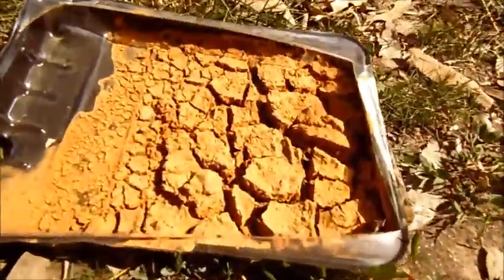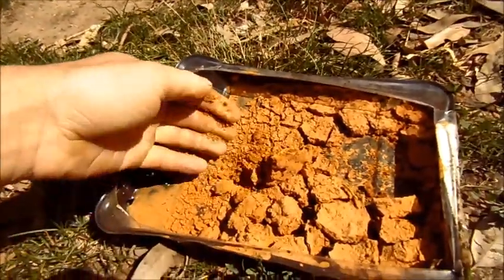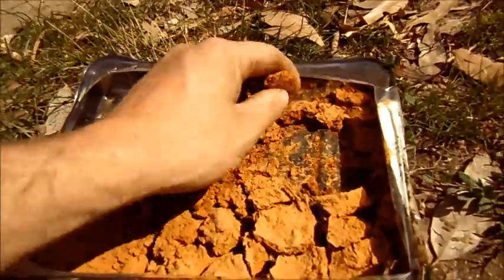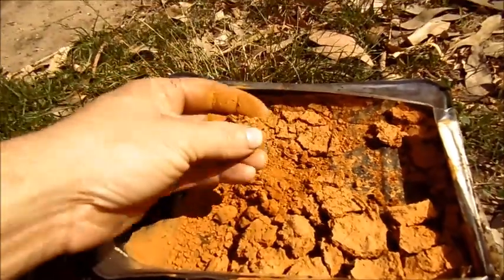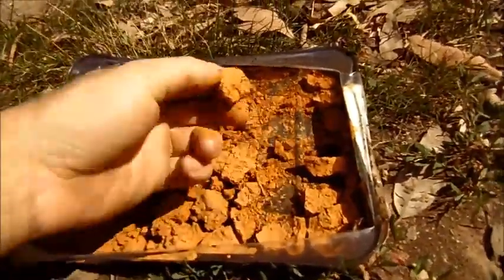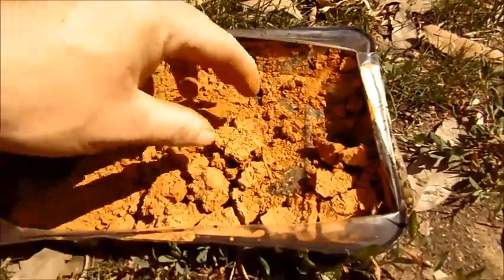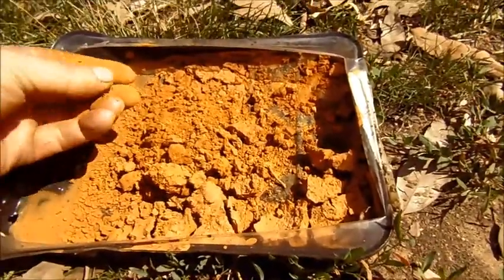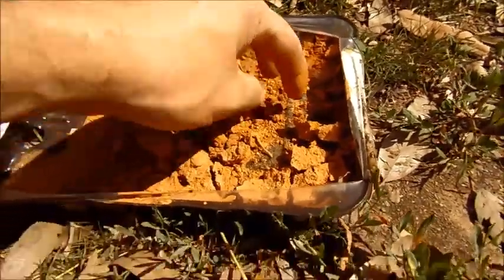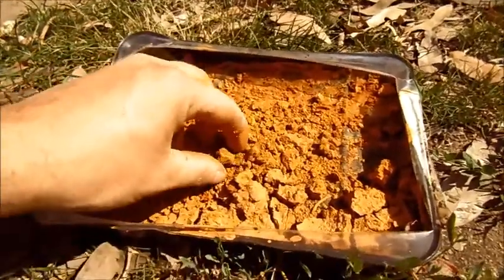Alright, so this is the raw material that I've got out of the mine. I've had it sitting in the sun for a few days just to dry it all out — makes it easier. You can see how it's still got a bit of moisture in it, but you can see how it breaks up a lot easier now. I was going to sieve out all the clay and impurities, but I don't think I really need to at this stage because there's not much impurities in it. It's mainly pure iron oxide. But I do need to break it up a bit finer, because finer particles, when heated, will start to turn to iron a lot quicker than the larger particles — because it melts quicker.